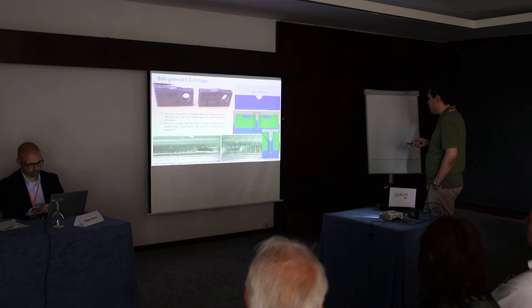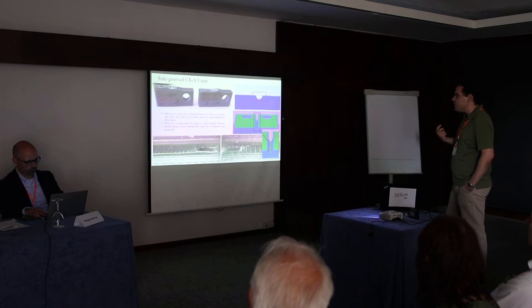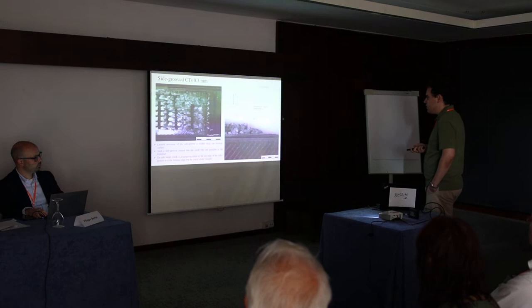So what developed is that the crack started in here in the middle and went up straight here. And somehow it hides behind these printed layers of the pre-notch. So at some steps we couldn't see the developed crack. That's why this geometry of side grooves proved to be quite bad. Just a few results were obtained with this.